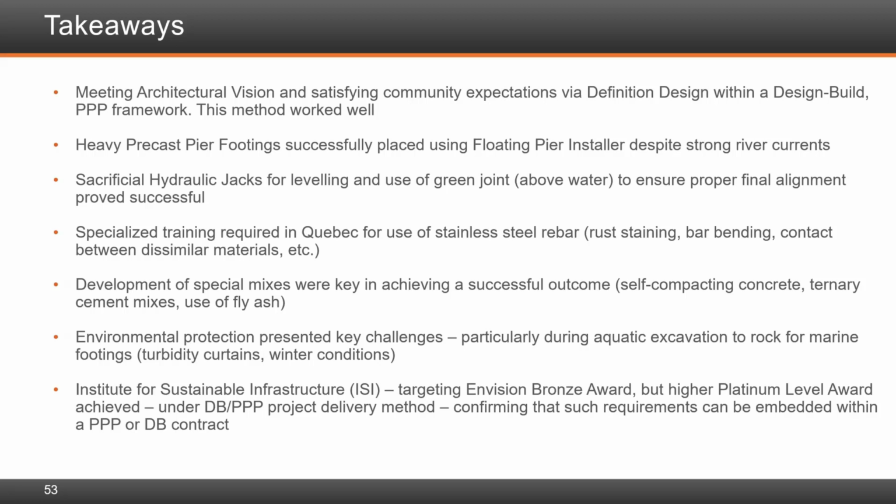Can you give some background about the lateral loading requirements for the piers and pylons and associated design challenges? Yes, so for the pier, the lateral loads one would look at are seismic, wind, and ship collision. You have the current loads as well as ice loading. And in particular, the marine foundations were governed by ship collision in the design of those, and then in some cases thermal.